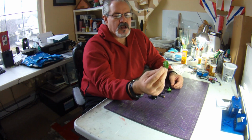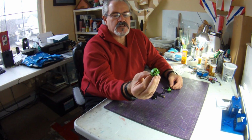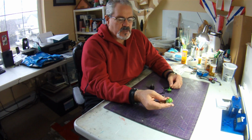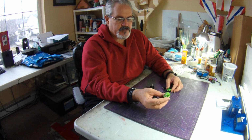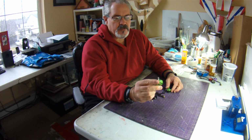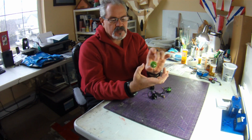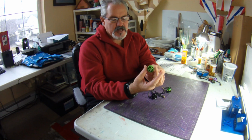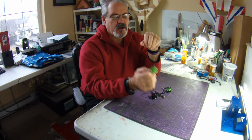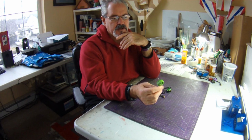So this is the Racer Star BR2406S 2600 kV. Another nice surprise from Banggood. When you read different reviews, Racer Star motors get mixed reviews because they are inexpensive. They're sort of the bargain level of motors. But I'm very, very impressed with how this works. In fact, of all of these motors here, probably because it has the fattest, maybe that's not a good word, but the widest, biggest diameter stator, this one has the most grunt, that low end torque, of all the motors, but it's not as fast as any of the other 2700 kV and more.